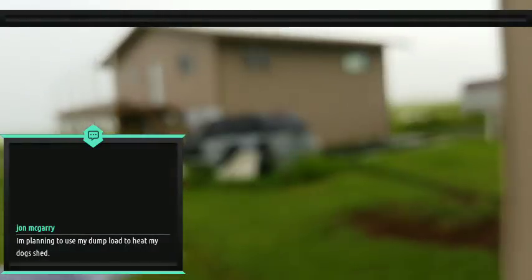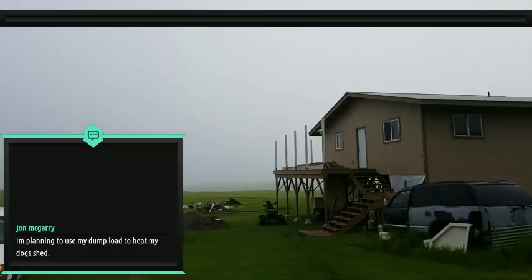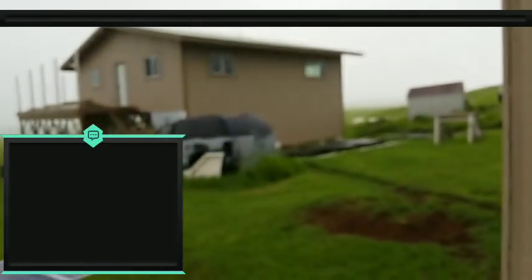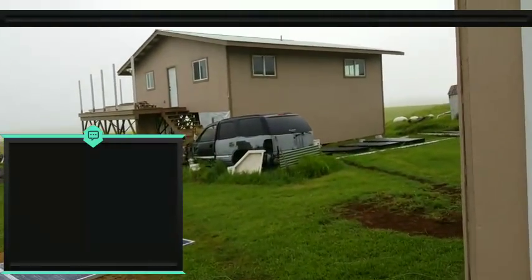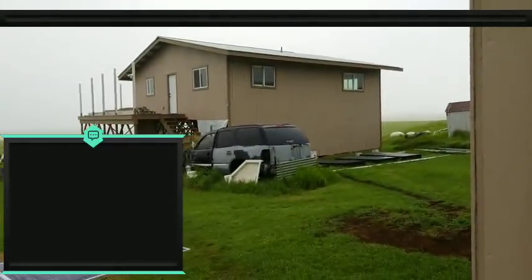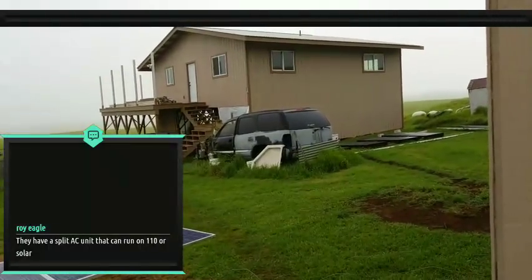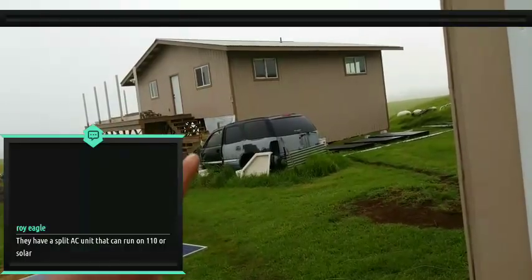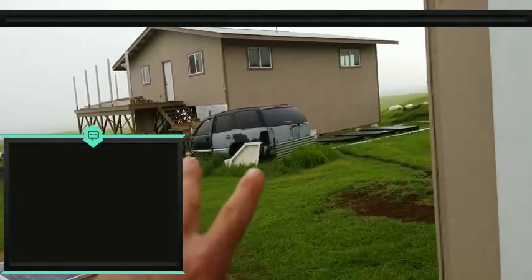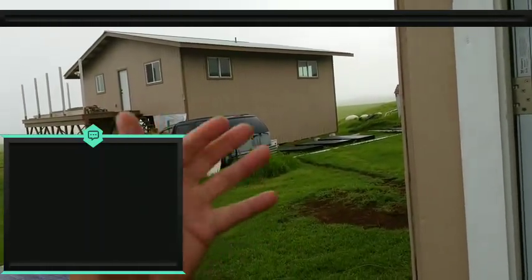But the problem here is that, see the days we have here, guys? This is not every day. This is once in a while. The majority of the time it's very sunny and hot. And so those solar hot water heating panels will be doing most of the work keeping my water hot. So if I have all this extra power coming from the wind turbine pumping into the element, then I'm heating up my water even more. And I have safety relief valves in place to keep me from going over a certain temperature, and they'll blow off that extra heat or pressure to allow cold water to come into the tank to cool it down. So that's going to work against each other, right? It's one of those problems. You have too much power and too much sun power too, as far as heating your water.